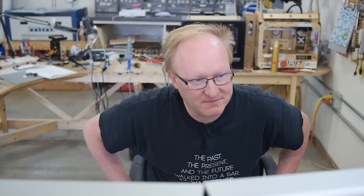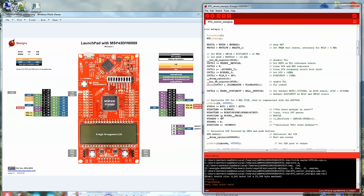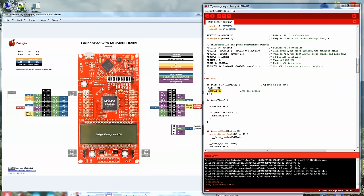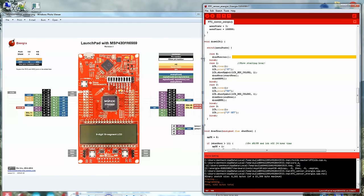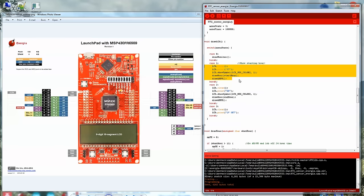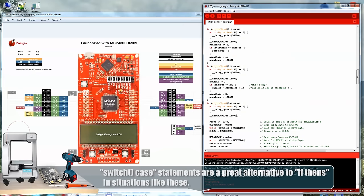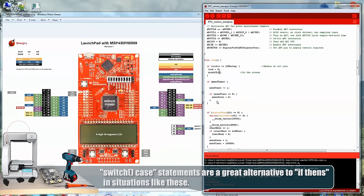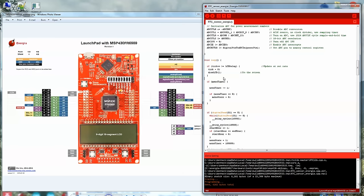Okay, so here is the main state of what's going on. We have a timer again, and after, I think it's like 10,000 cycles, it will draw the LCD, and the LCD has a state to it, which is down here. It's either in monitor mode, which is where it just shows the time in the bar graph, the start hour mode, when you're setting it, the end hour mode, or level set mode. So we draw the LCD, and then we see if there's a timer. So the timer, basically, if you push a button, it'll switch the LCD state, and then after 2 seconds, it'll go back to the monitor mode, which is what it's doing right now.